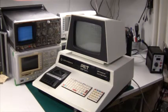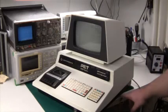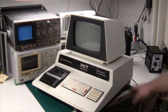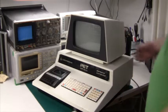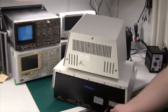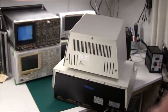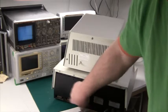There are a couple of connectors on the PET. Down here on the right side of the machine, there's a PCB connector — just gold fingers, really a cheap solution. There's no connector as such; it's just a bare PCB with some gold fingers. If we rotate it around to see the back, there's a power in, a fuse, an on-off switch, and more of these gold fingers. For some reason, there's no silkscreen on these.